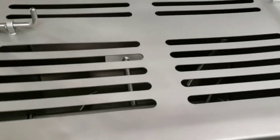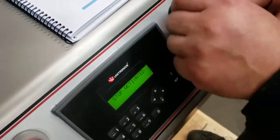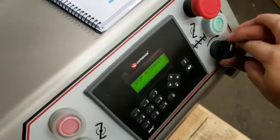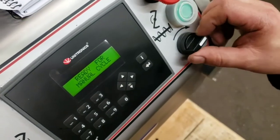At any time there's product that gets stuck inside the grinding head, you have the option over here for reverse. Okay, so you touch this button over here, and it will reverse the product out from the grinding head. Okay, so you can see here it's in reverse mode. When he's touching the reverse option here, that's when the user thinks that there might be product stuck in the auger head.